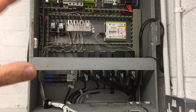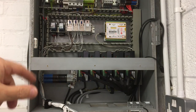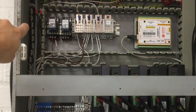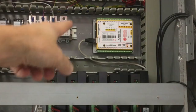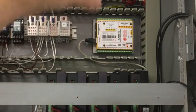So I think essentially we've got enough wired up just to give a little bit of a test for some of the logic systems and some of the auxiliary systems down there. The only thing you may be interested to know is on the back of the master there, you can see that brown wire coming out. At the moment that goes to 0 volts just to ground the other side of the coil, but ultimately that will go to the O1 up there on the charge pump, and then the charge pump will do the grounding.